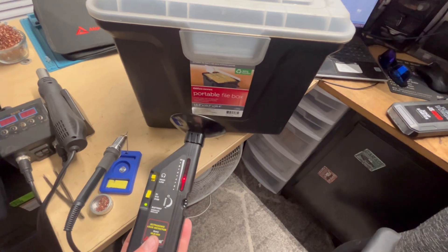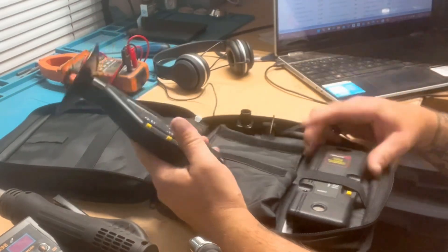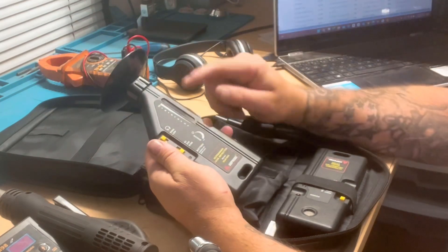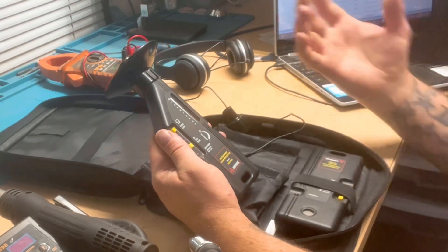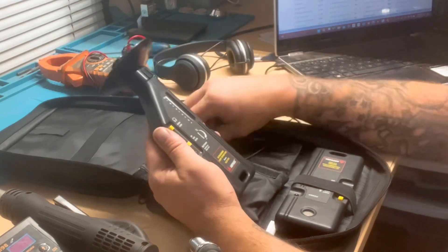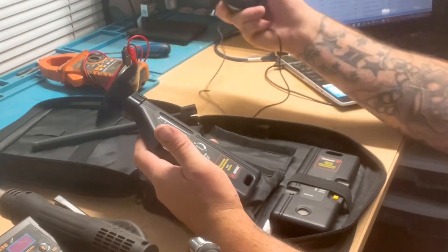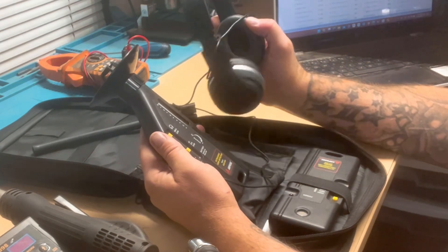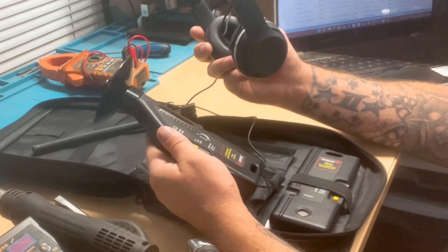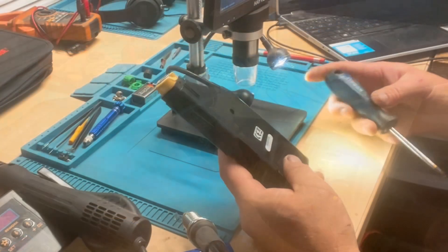Pretty neat — if it's something you just can't see, a super slow leak, this could be your friend for sure. Now, you can't always put this transmitter in a box, so the satellite dish attachment and the tube attachment clip to the front. You're supposed to hear the leak in your headphones — there's a headphone jack right here — and when you put these on and get closer to a leak, it amplifies it so you can physically hear it. The problem is that doesn't work on this unit.